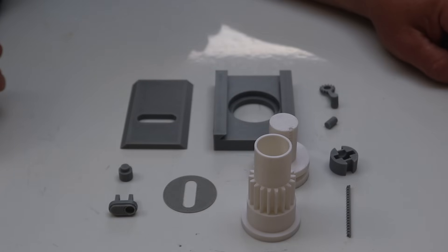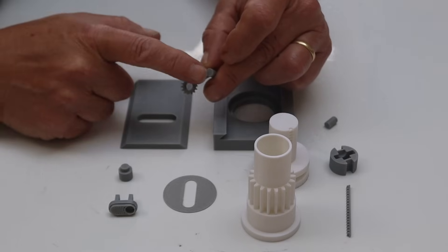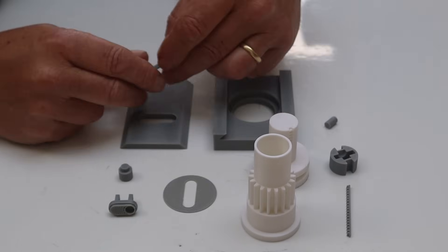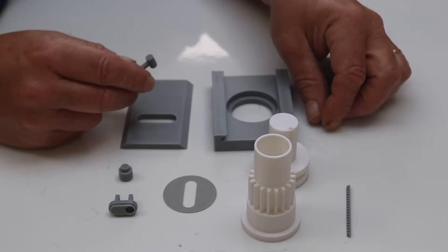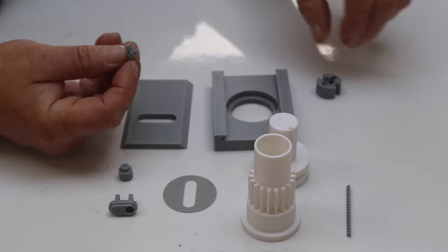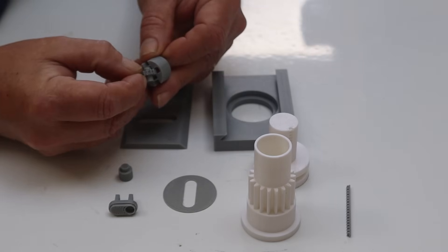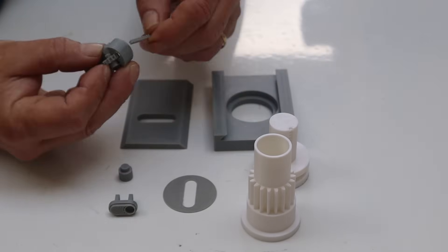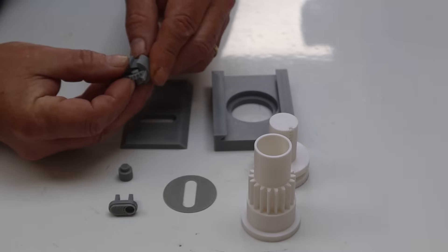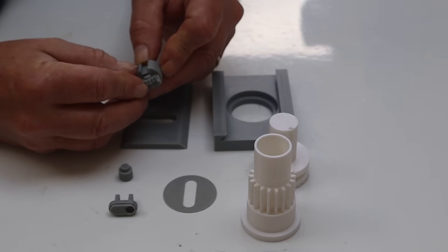The heart of it is this tiny piece here - you can see it's got a gear at one end, a little hammerhead at the other, and then a shaft that actually fits into this bit, which will go into the central body. There's a small pin which goes through the gear and shoves in there to lock it into place. But before you do that, because it will all lock into place, we have to put the rack in - put the rack in from the top leaving about three little teeth sticking out, and press that firmly into place.